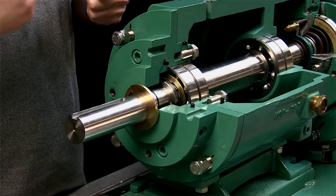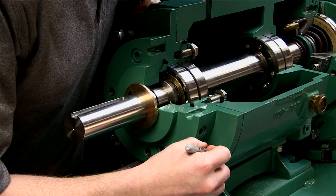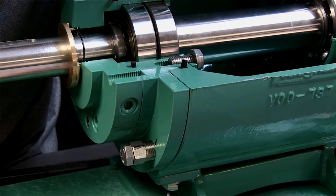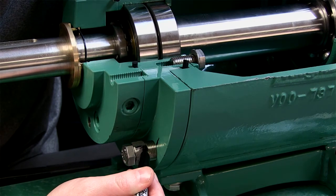Adjust the clearance between the backside of the impeller and the upper cutter before adjusting impeller to cutter bar clearance. The upper cutter adjustment is achieved by adjusting the thrust bearing cartridge at the motor end of the bearing housing. Before you begin to make adjustments, you may find it useful to use a marker to place reference marks on the adjustment sleeves and on nearby fixed surfaces to help you keep track of how far the adjustment sleeves have been rotated.